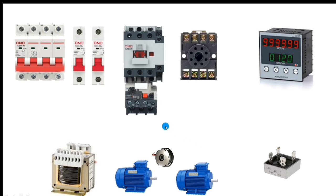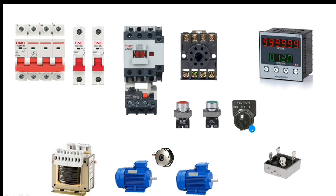For push buttons, we connect one stop push button with an NC element and one start push button with an NO element. We also connect a selector switch with two NO contacts: the first NO is for the holding power supply of the motor starter, and the second NO is for the DC rectifier supply. When the machine is in stop condition, the clutch supply should pass.